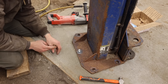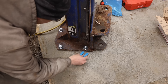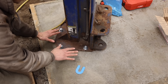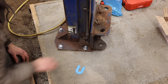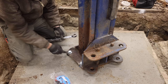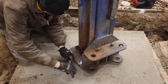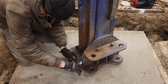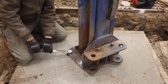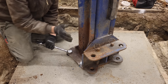I'm not going to tighten this yet because I want to put shims underneath it as necessary. This one actually looks pretty level — I don't know if it's going to need any shims. I got all of the anchor bolts in. The biggest gap is over here and I can't even get the smallest shim I have in there, so I think this is okay. When I tighten these down, it will bend the steel just a little bit to conform to the concrete. On the other side I did end up having to do a little shimming, a maximum of a quarter inch. I'm not going to tighten to 150 foot-pounds right away — I'll just snug these up so I don't put a ton of stress on the concrete until it's closer to being fully cured.